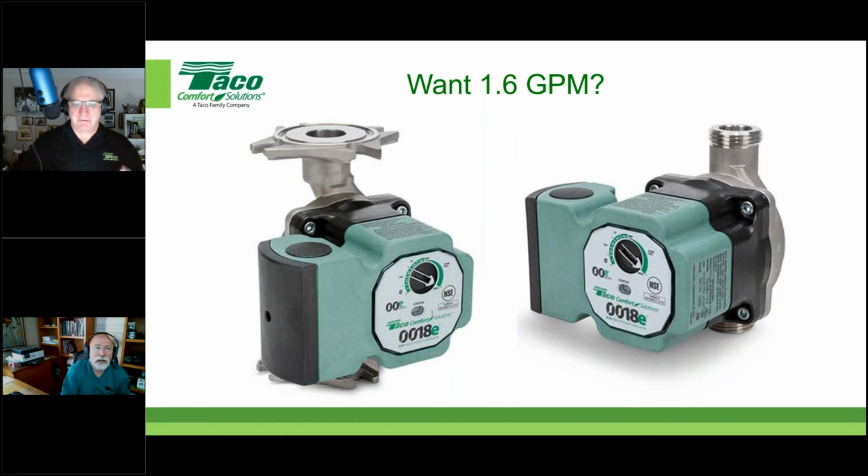I'd like to add something, John. Kirk, just realize that I think what you're talking about is when the circulator is installed on the hot water line going out to the fixtures. You don't have to put it there. Right. You can put it on the dedicated return line coming back, and it'll never impart any additional pressure drop.